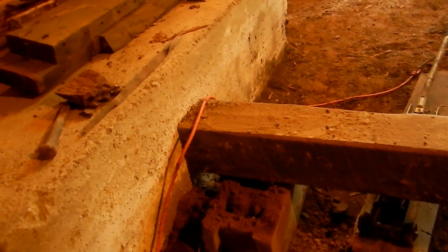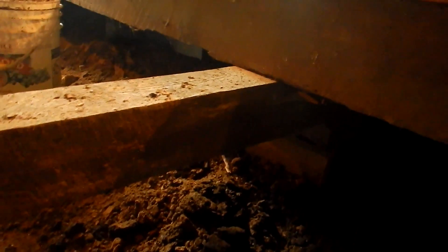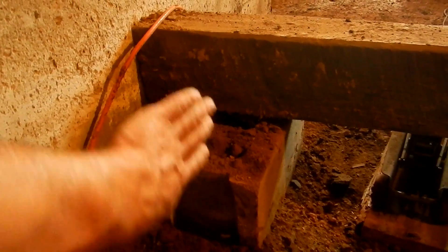If it's not one thing it's another. Peeking down here — this is a support beam that runs underneath the floor. The span is just over 20 feet, so that's a long way without any support, especially with two-by-eights. It was just sitting on a cinder block and the cinder block has sunk into the ground, which is why the floor in this room has always been bouncy. I've jacked it back up into place. I'm going to pull the cinder block out, dig a hole, put in a piece of six-by-six beam, and cement it in the ground so it will never move again.